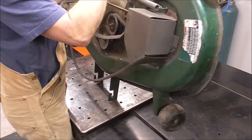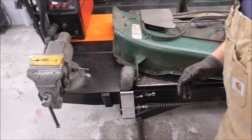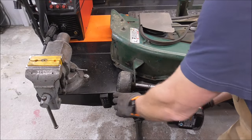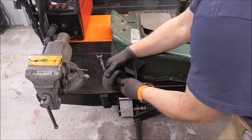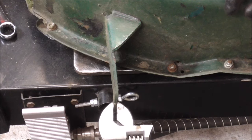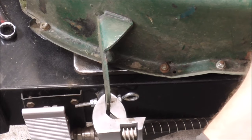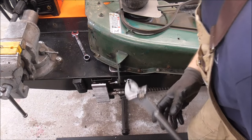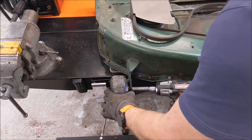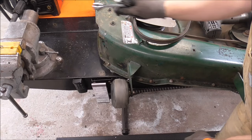All right, let's get this flipped over and get that welding done. Let's get this leg straightened out — you can see how it's kind of canted off at an angle. We've got to bend this bracket straight down here — we'll throw a spud wrench on it and try to get it straight. Now you can see how it's straight here and then it cants off that way. There we go — look how much better that looks guys. Now that's all straight.